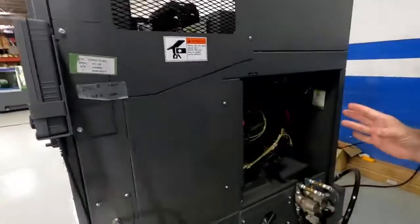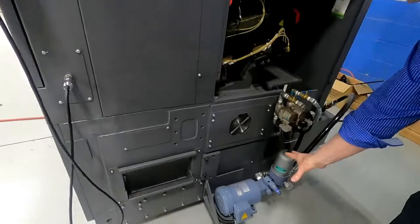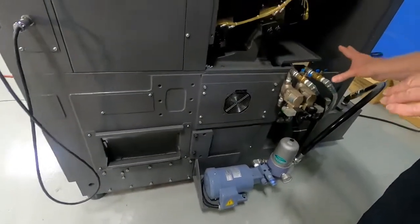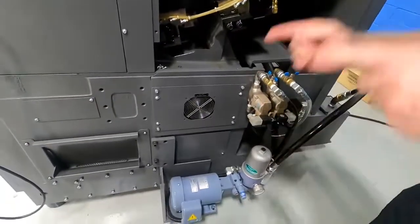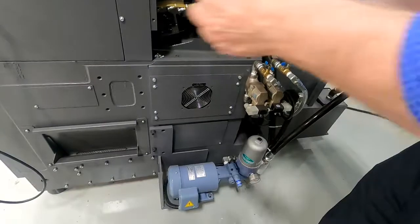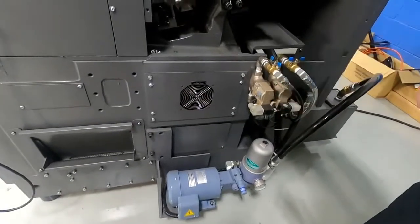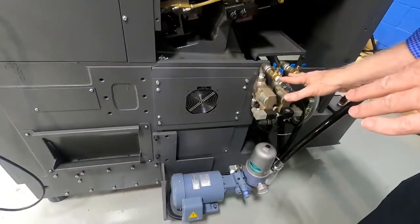This particular machine I always bring in with high pressure coolant. This is the high pressure coolant pump — it's about 300 psi and provides volume and pressure. We have M-code switching of the high pressure coolant through the spindle, which is very important if you're doing any ID cutting — you want to be able to push those chips out through the spindle. I also have high pressure coolant to the turret, so you can switch between spindle-through and to the turret by M-code.